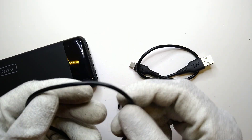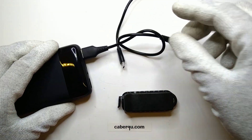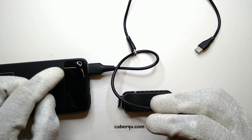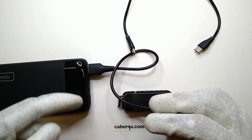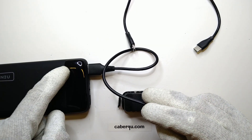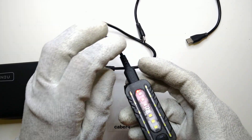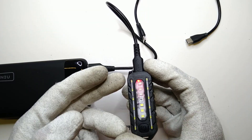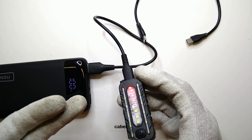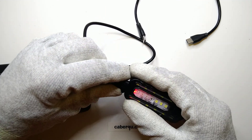I can show you quite easily because if I just plug in the USB-A to USB-C cable, the USB-A connector always has power applied — it always has 5 volts and it has no way to detect a device being connected. This means the power bank in this case has to provide power at all times and discharge itself just to provide the 5 volts on this output. And if I connect the light, you can see this little red LED immediately goes on indicating that it is charging. The charging current is high enough for the power bank to actually notice that, so it sprang to life and shows me it's still at 100%.